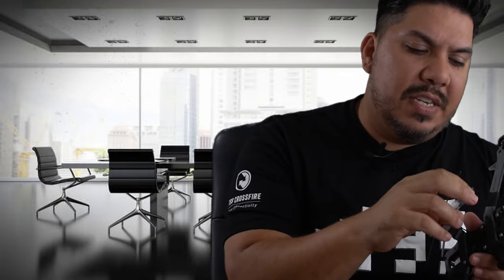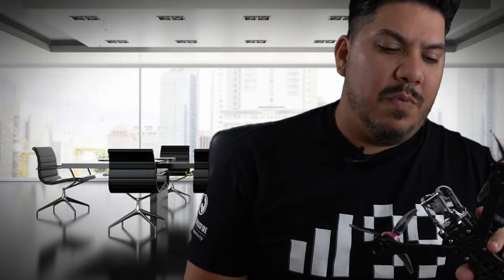This makes the build go by so fast. I do suggest that like any new build, you carefully lay out the components before you start assembling them. I actually did twiddle with moving the stack around a couple of times before I got the layout just right. But all of this goes together quite well — it fits together so perfectly. The DJI image on this thing is incredible. I really like having a six-inch frame, even if I'm going to fly five-inch props, because that gets you a little bit of additional separation from the props side to side and front to back. That gets you cleaner air to those motors, and it's going to make it fly a little bit smoother.